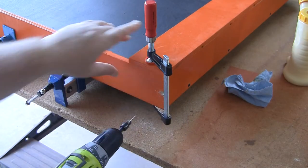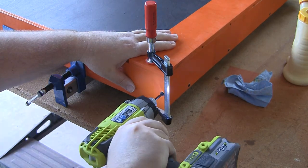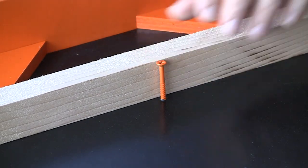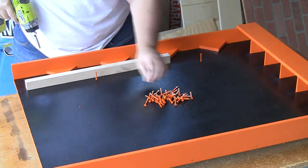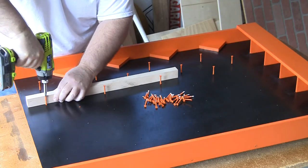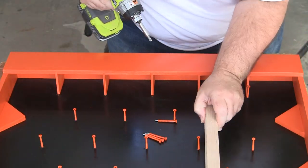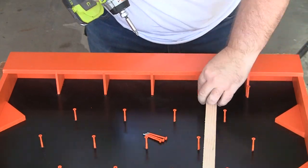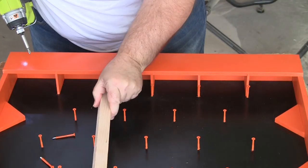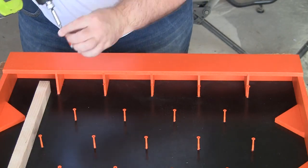Don't forget to add glue to attach the sides to the bottom as well to really secure things up. Once you've inserted the screws, remove the clamps and repeat the exact same thing on the other side. I attach the second side the same as the first, off camera. At this point the Plinko board is assembled and only needs the pegs to be inserted. I gave everything 3 coats of spray lacquer before inserting the pegs. I calculated that I needed 1-1/4 inches of the screw sticking out from the front, so I cut a piece of scrap wood to 1-1/4 inches and used that as a guide. When the screw head reached the top of the scrap wood, I knew it was in the correct amount. Pre-drilling really helps the screws go in straight.